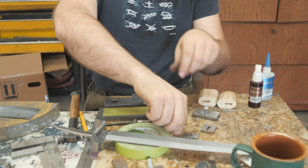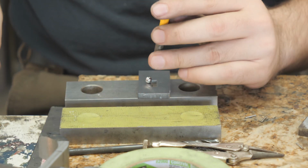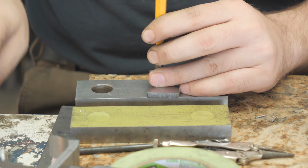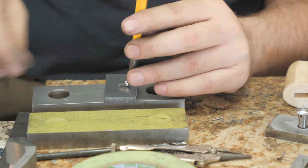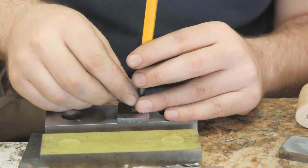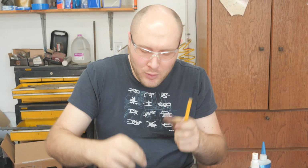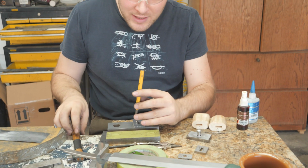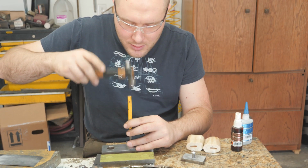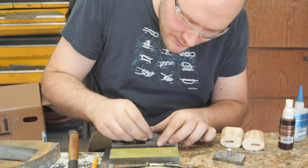I can pick it up. So I got a little ball bearing. I'm just gonna stick it on the hole, and then I take a punch, lightly hit it a couple times. In this case, the other hole needs touched up too. And then I do it on the other side as well. That actually pushes a tiny bit of metal back into the hole and makes it so the pin will fit really nice and tight. In fact, you can get the pin to fit super tight or just a little bit, depending on how much you hit it. So now the pins should fit really tight.